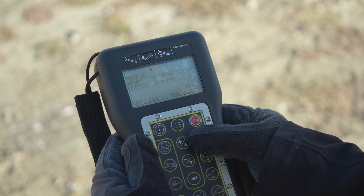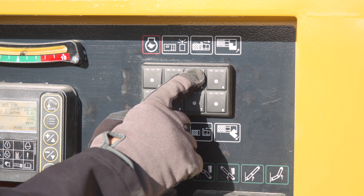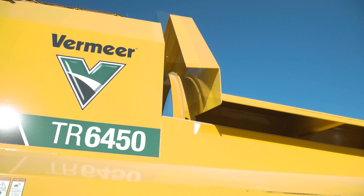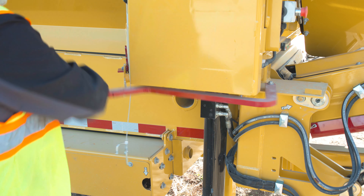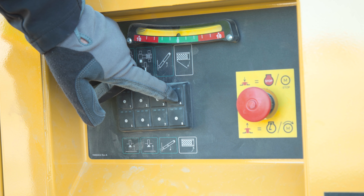Press the auto screen button to automatically stop the drum and conveyors. Slide the hopper out of the drum using the key. Unlatch the door. Open the drum door fully using the key.